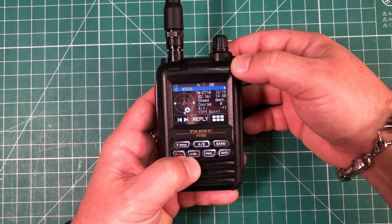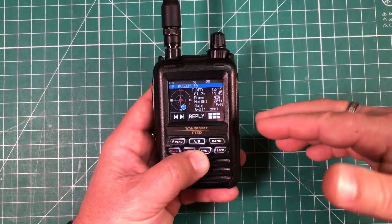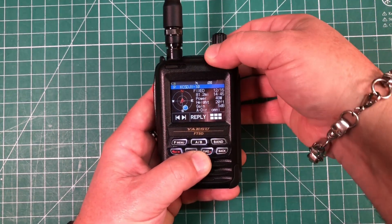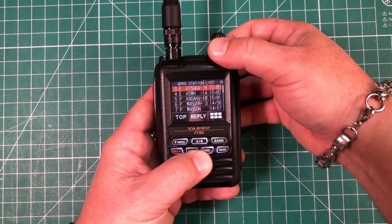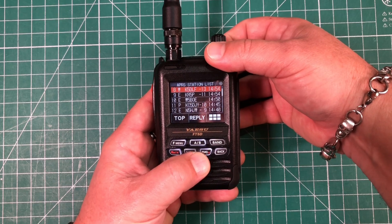The icons like E, P, and W mean different things according to an APRS reference chart — W means weather, for example. I picked up a weather station, and hitting the F button shows it was 67 degrees Fahrenheit today. There's another fixed station 81 miles away with linked digipeaters, running 49 watts at 20 feet with an omnidirectional antenna. You just get all kinds of neat station info as you drive around. Thanks for watching — if this helped, hit subscribe, leave a thumbs up, and follow me on Twitter at K8MRD. See you on another episode of K8MRD Radio Stuff. 73.